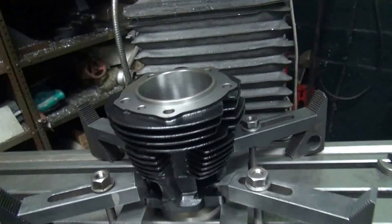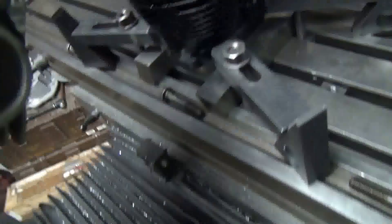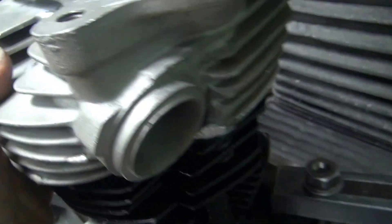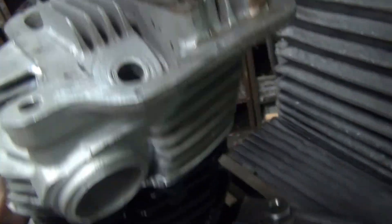So this way I can go ahead and use the existing head bolts that the factory uses. Just lay it up on here like that and we should be good to go. I'll be able to cut all these surfaces, do whatever holes I need to fix, and do everything in one shot.